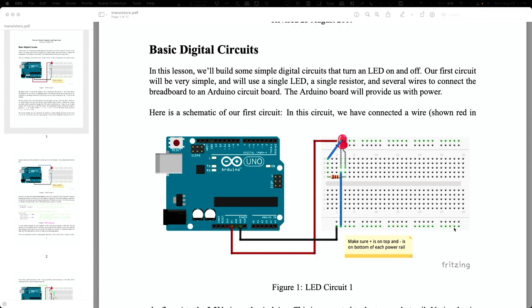Okay, so the other thing is that the convention about direct current power is that current flows from positive to negative. Okay, so when we say that, we call that conventional current. However, that's actually wrong. Okay, so the electron was later discovered. And which way do the electrons actually go? They go from negative to positive, okay? So current, when we talk about current flowing, it's actually going the exact opposite of the electrons. We had a 50-50 chance of having conventional current be correct, and we guessed wrong. But it's been that way for so long that you just deal with it. Okay. Current flows from positive to negative, even though the electrons are going the opposite direction.